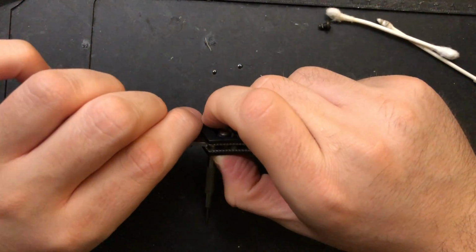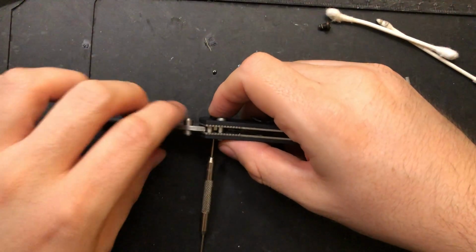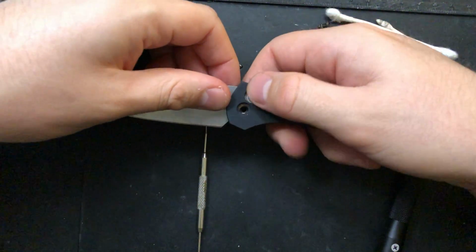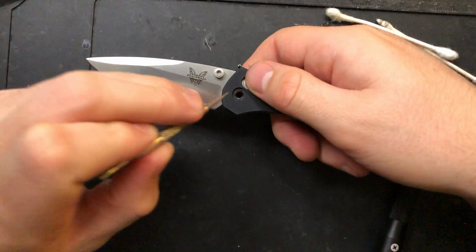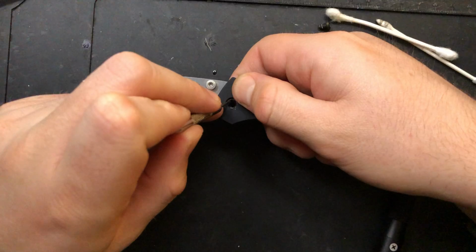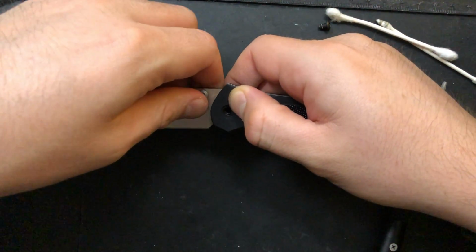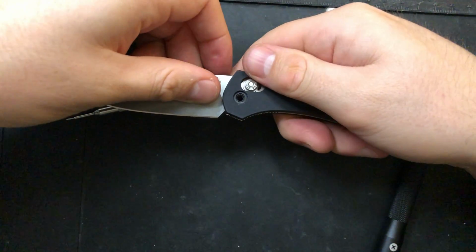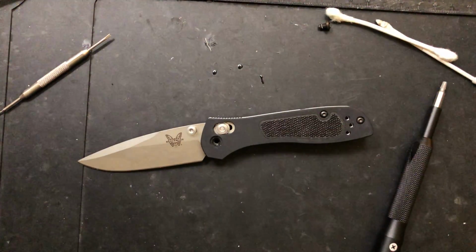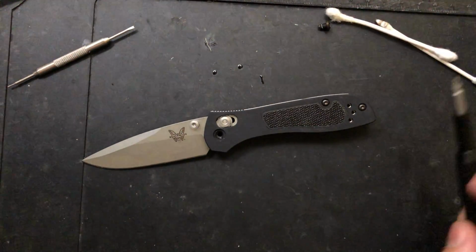Oh, yeah. So what just happened is that I slid through the first washer as well as through the blade itself, leaving behind the only thing remaining, this other washer here. And so all I have to do now is move this little washer using this little tool a little bit to the side, apply a little bit more back pull to the axis lock, applying pressure with my index finger. I almost made that look good. Alrighty, so at this point in time, this is entirely reassembled, and God dang, that looked easy. I'm happy about that.